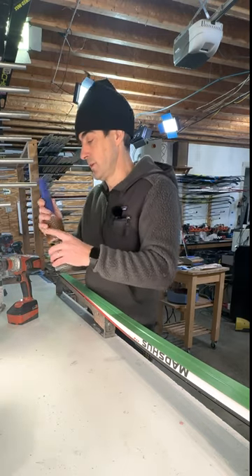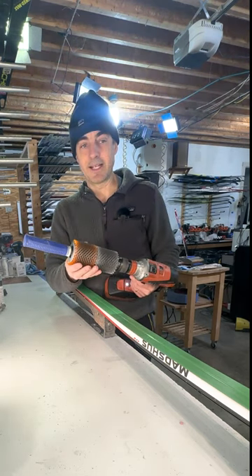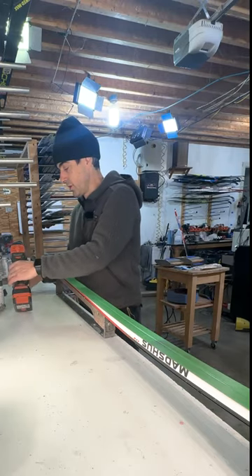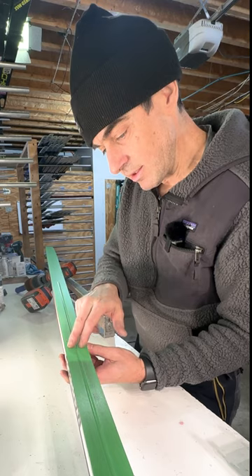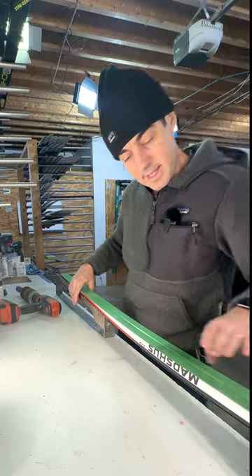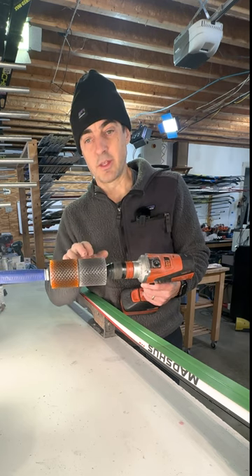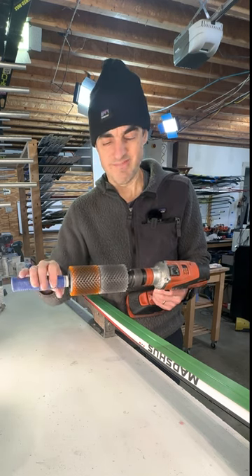Now we look at the nylon brushes. The gold brush is really intended for polishing and moderate film management — not to do too much aggressive work. It will reduce the film for sure, but hopefully you can see there's still some black left in the middle whereas it's really stripped off at the ends. The white nylon is a little bit of a surprise — because it's relatively short and fine, it actually gets into the structure very well and moves this material pretty quickly. It seems to reduce film just about as quickly as the gold brush, and maybe a little more quickly in some cases.